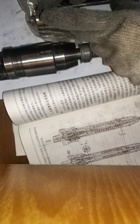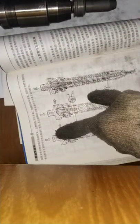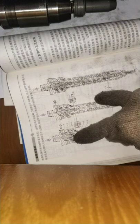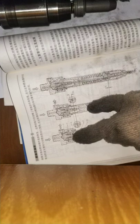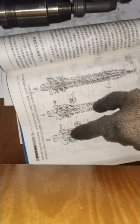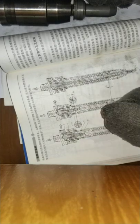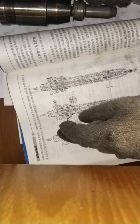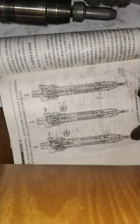The non-return valve has a spring inside. The oil flows from top to bottom. When the oil pressure is not high enough, the oil will go through the side hole and into the clearance between the non-return valve and the fuel injector body — shown here as the black area. The oil will flow and circulate out. This circulation is used to cool the whole injector, as the oil flow carries away a great amount of heat transferred from the nozzle tip in the combustion chamber.